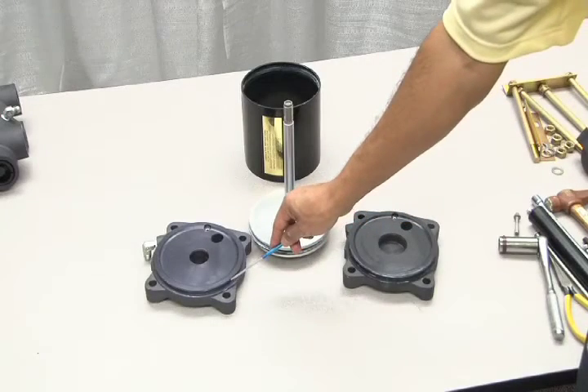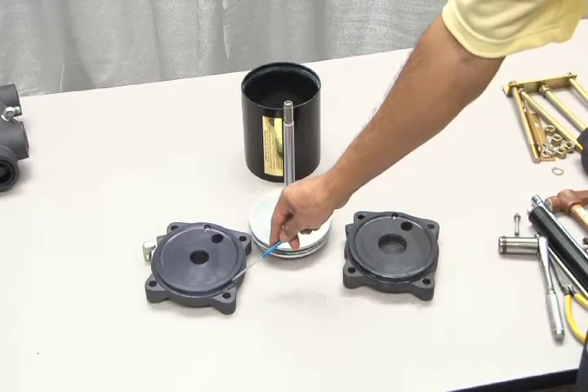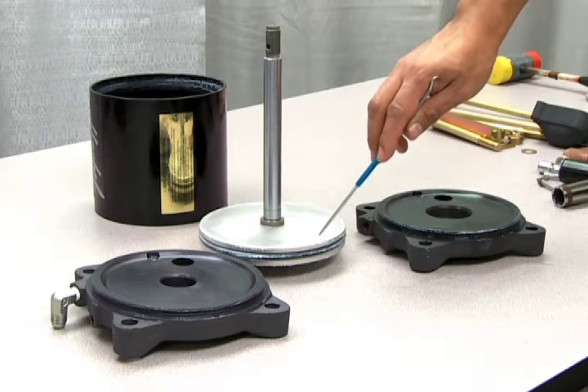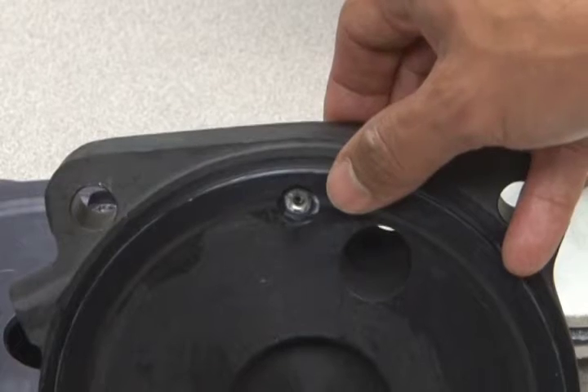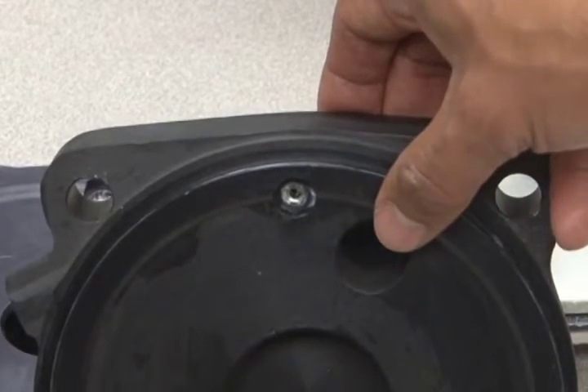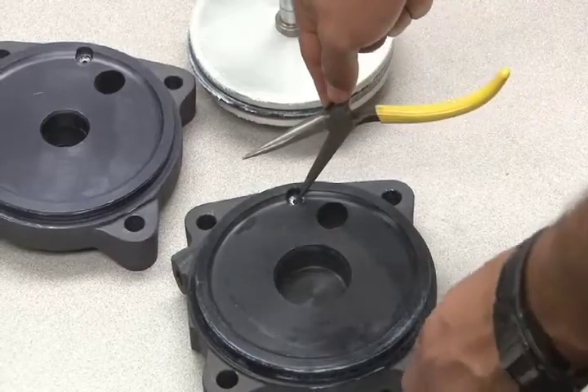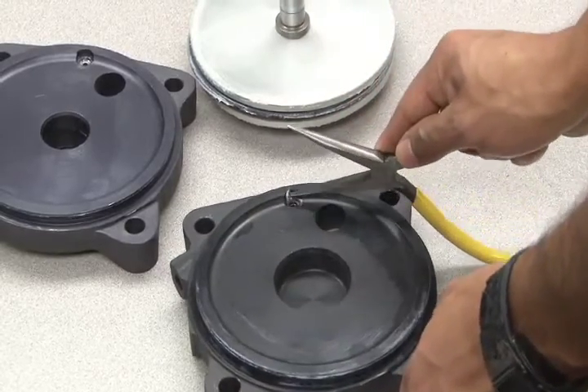As with other models, there are large O-rings located on the end caps where they meet the air barrel, and another large O-ring on the outer diameter of the piston. Also located on the end caps are the stamped packings for the pilot stems. To remove these parts, use one prong of a pair of needle nose pliers to pry them out.